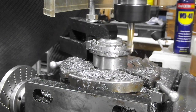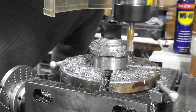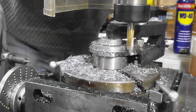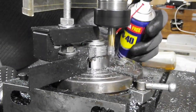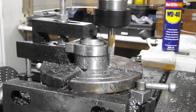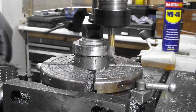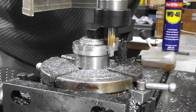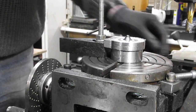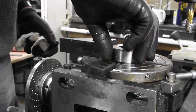The very last cut was taken at full depth but only about 10 thou depth of cut. The problem was that because of the full depth of cut the finish wasn't particularly good. I decided to machine the radial cut to size plus about 0.25mm, and the 58mm outer diameter had to be filed eventually, so that's what I did. As I dismantled the table you can see how the whole thing actually did fit together — yeah, a bit risky, but it did the job.